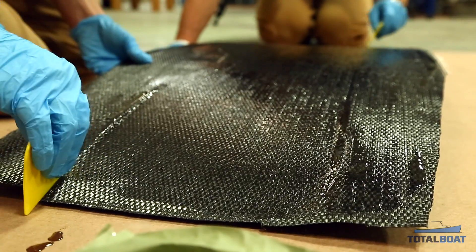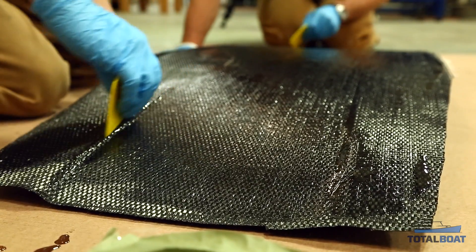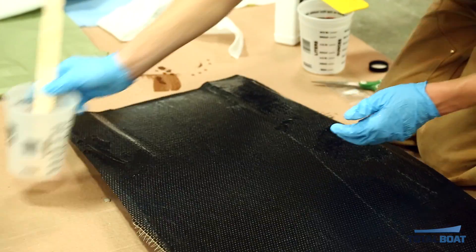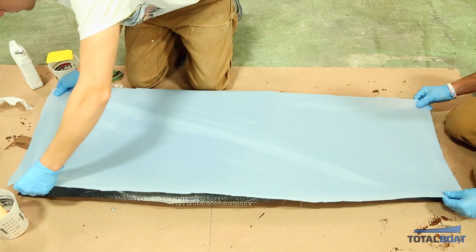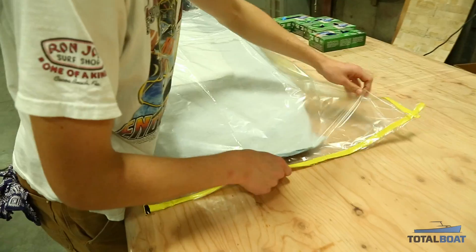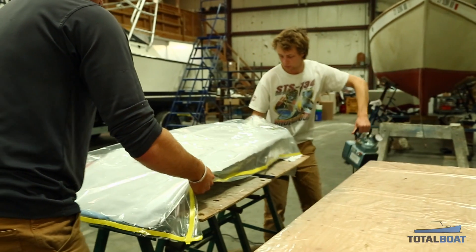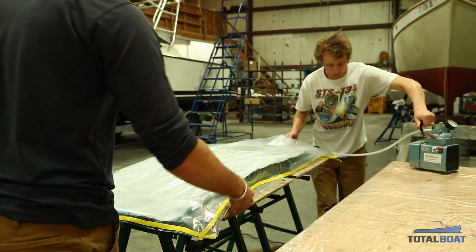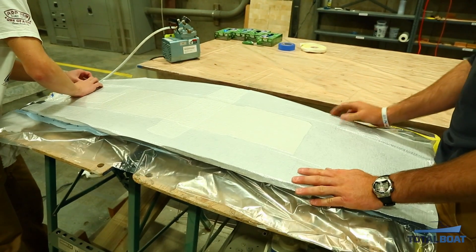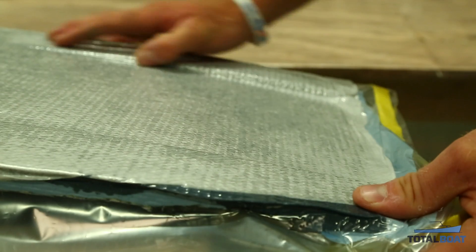One trick is to make sure the carbon fiber is laying nice and flat — you'll see us pressing it into the foam, especially in the corners, which is really important. The vacuum bag will help, but if you don't work it in originally and don't get enough epoxy in there, the vacuum bag won't be able to bridge that gap. We then put the peel ply on, then the breather just the same as before, and the only difference this time is using an envelope bag instead of working on the mold, because we have channels shaped into the board that aren't in the mold. I shaped the channels knowing the top skin would hold the shape, and used an envelope bag to pull the carbon to the foam for a nice tight bond.